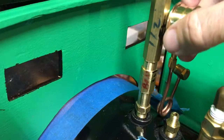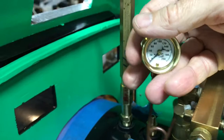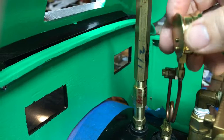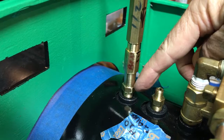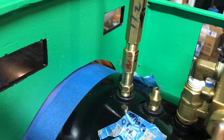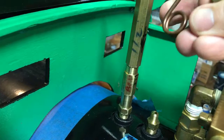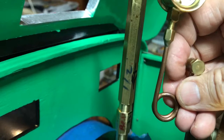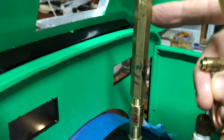This most forward opening on the top of the boiler is where I had planned to attach the American Model Engineering pressure gauge - the nice deluxe one that they sell. What I didn't realize when I first bought it: I had made a little adapter that screwed in here with a pipe thread - it's a quarter inch pipe. I thought I would fasten this part directly to it and just bend the copper up. What I didn't know was that it's very important to have a coil in between the gauge and the actual steam from the locomotive, and it also mattered to have the orientation just like this.